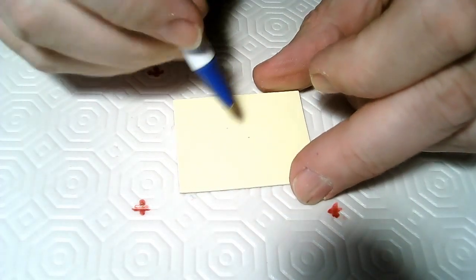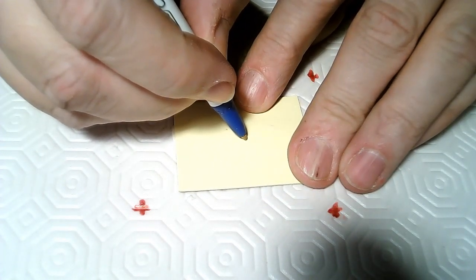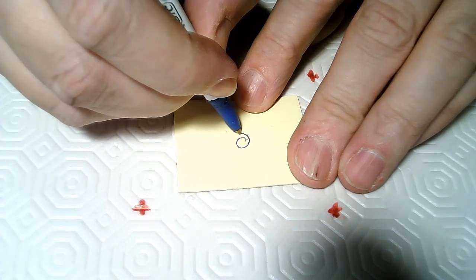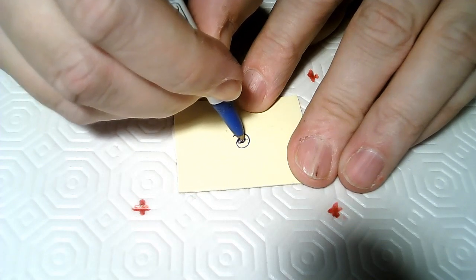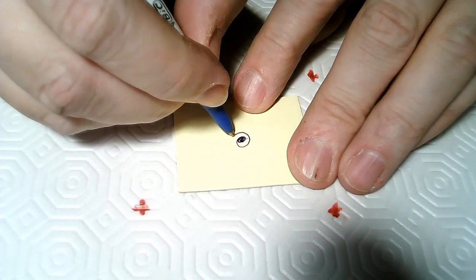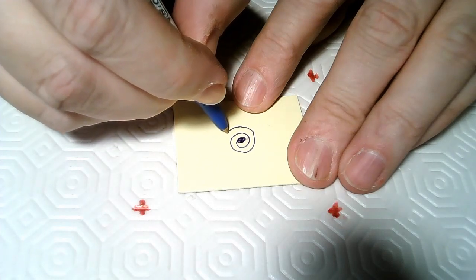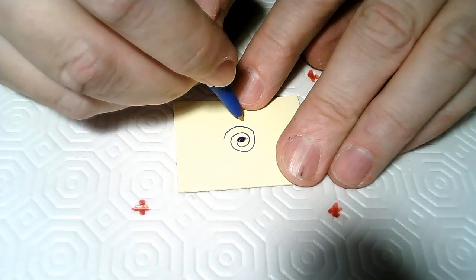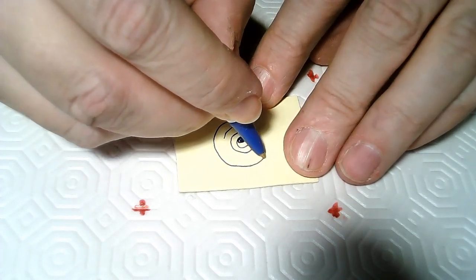So what's happening here is you've got your arbor here in the center, like that, and this spring is going around like this, and I'll exaggerate it. There's your center arbor here. Right, I'll just make that solid here. Solid. And your spring is going around like this, and of course it bunches up, but I won't show you that. And then at this part here, the barrel, I'll just exaggerate this again. So the barrel is like this on the inside, right?